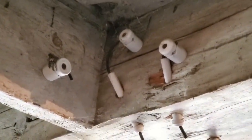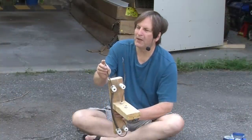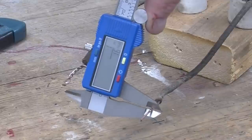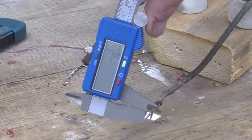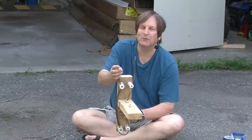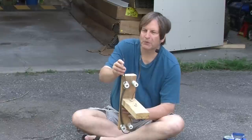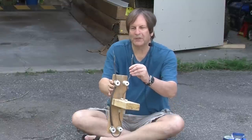I'm not 100% sure how old this is, but my guess is it's perhaps 80, 90, or 100 years old. The wire itself — I measured it, and it appears to be about the diameter of number 14 wire, which for modern wire would be rated at 15 amps. The insulation is soft rubber covered with cloth, and if we examine this wire, that's what it appears to be.